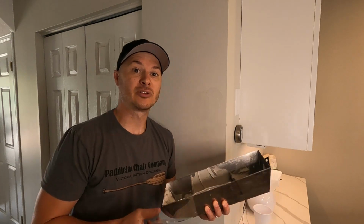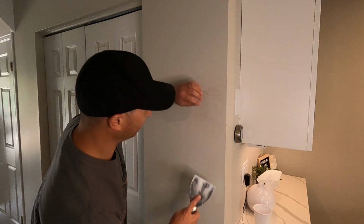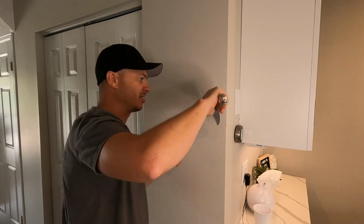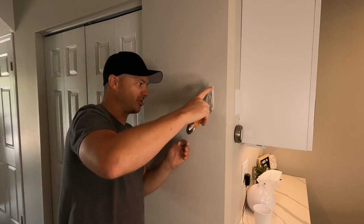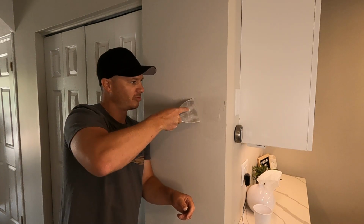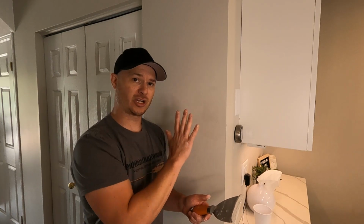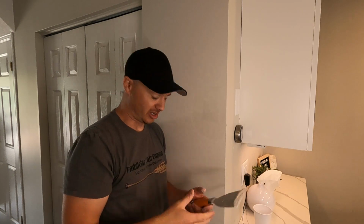Now, this is pretty thick, so it's going to be tougher to get out. If you have a little bit more runny mud, it's going to be easier. But again, you just kind of hold your knife flat. Try and get some of the excess out of there so that you're not building it up too much without ripping it. So that's pretty good there. If you want to leave that, you can actually leave that the way it is, and it's going to shrink up and suck that in really dry if you've got the time. I never seem to have the time.